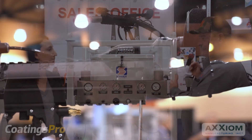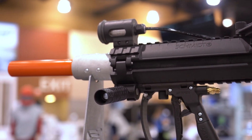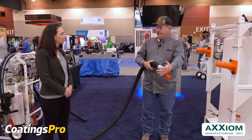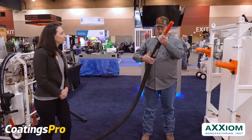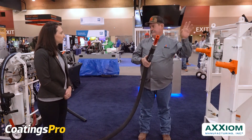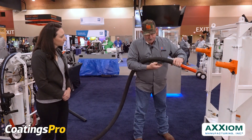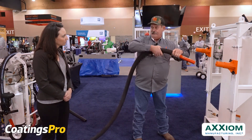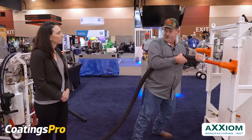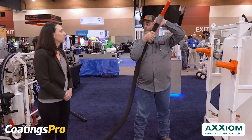Here in a second, we'll transition to the back of the machine where I have a simulator for the thrust that I'll show you how this system works. This is a spring-loaded thrust simulator that, as you apply force, mimics the thrust that the nozzle creates on the operator. In my hand, without the BABS, is a normal dead man control that operators are using throughout the world. As my hands are showing you, that operator has to set a safety button, depress a lever, two hands on hose, and his arms are handling all of that thrust.